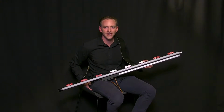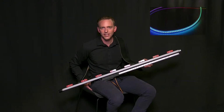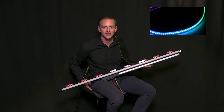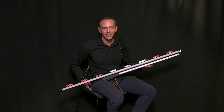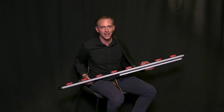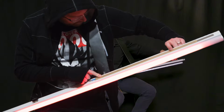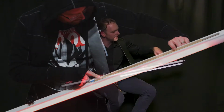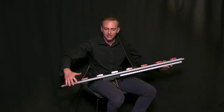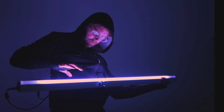And I took the LEDs out of it and replaced it with my very own individually controllable 144 red, green, and blue LED lights. And then I also put in some motion sensors and a linear position sensor to imitate a guitar fretboard on the top to track the position of a finger. And then I did a non-contact motion sensor here to do air guitar gestures.